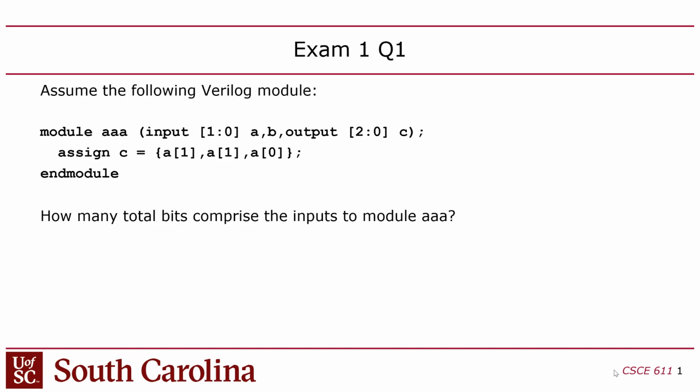That's a good question. Just in case you didn't hear that, the question is, how do you test the CPU? I mentioned that normally when I'm testing, I run a program, like the test program that I gave you, and I just check the state of the registers in the waveform viewer. But if you want a self-checking test bench, an external test bench that checks the results, the only way to do it with the pinout of the CPU that we provided is to have a program that tests some instructions and then uses the CSRRW instruction to output the result of that instruction sequence to the output port, and then check it from there.